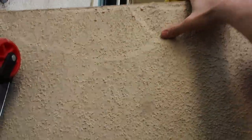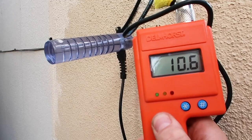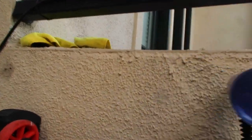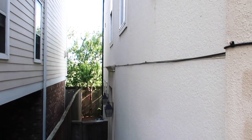Up here is the area with the problematic stucco — you can see they've done some prior repairs. We'll see if it's dry and go downstairs to check it out. I'll test the same spot the prior inspector tested, and if I get moisture readings or a compromised substrate from the bulging, I'll come down about a foot and test there too. I'm actually surprised — I got a 10% reading over here and a 9% reading over here, and it's solid. You never know what you're going to find; just test your problematic areas and go from there.